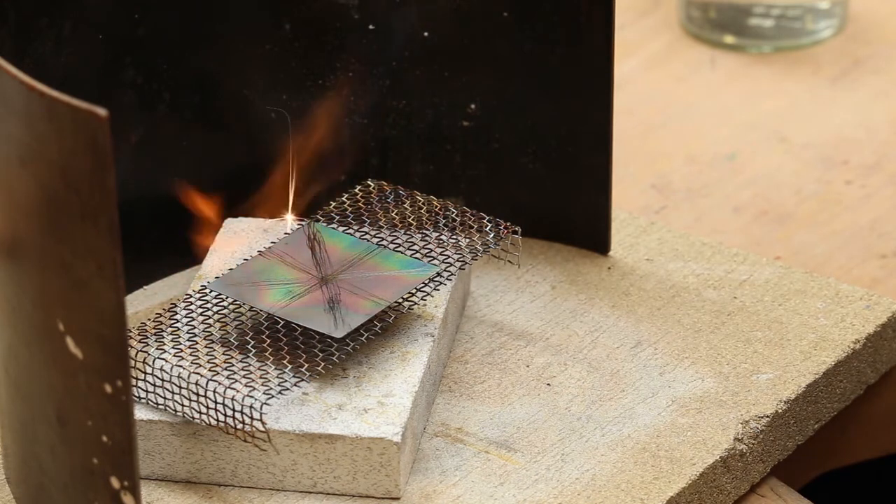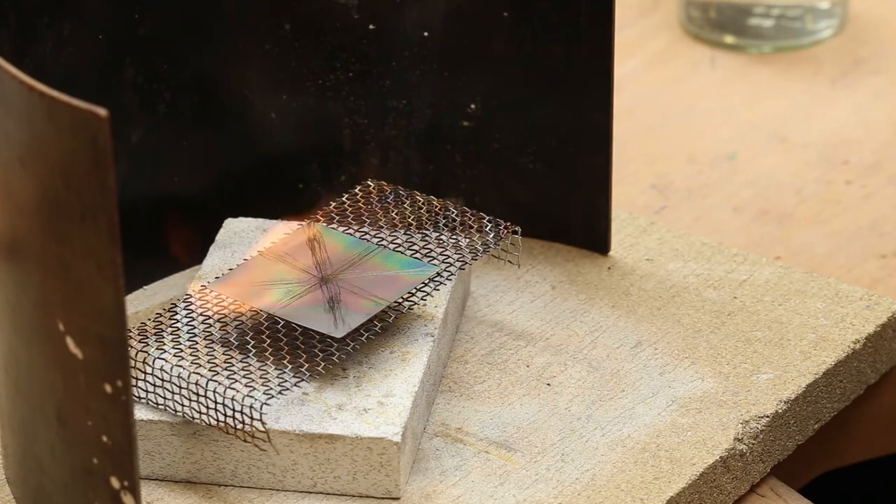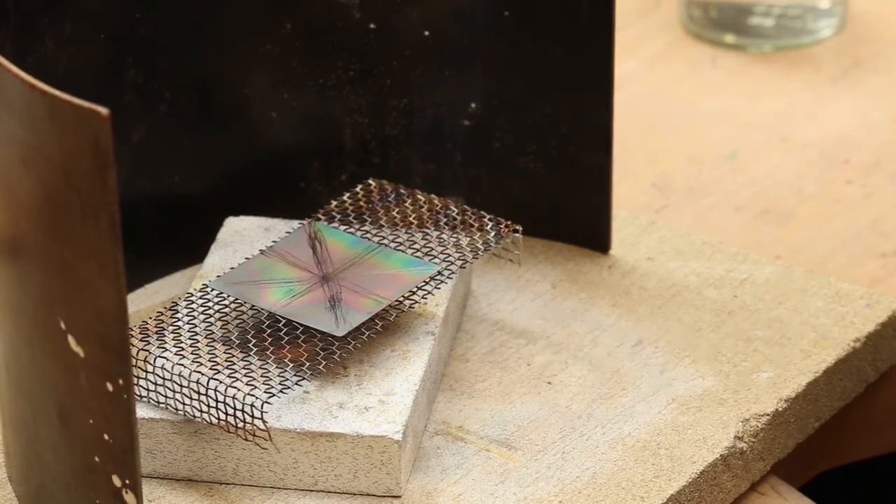The thing that is quite key when you're colouring titanium is to know the sequence of the colours, and if you're aiming for something specific, to recognise when you're nearly there — like the stop on the tube before the one you want to get off. You can see the background is giving up on colour because the oxide layer has got quite thick.